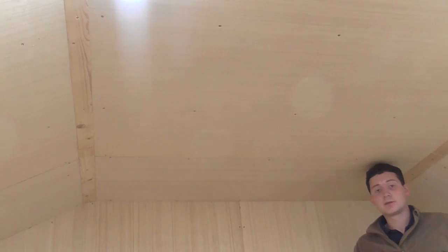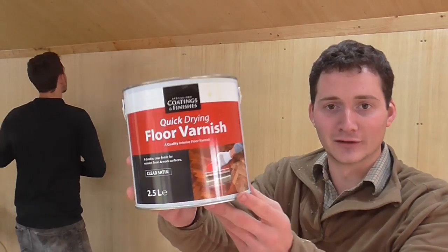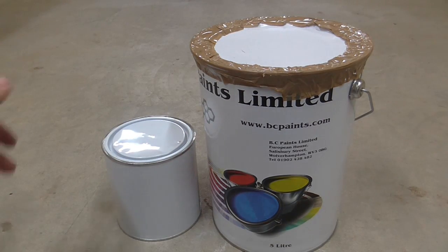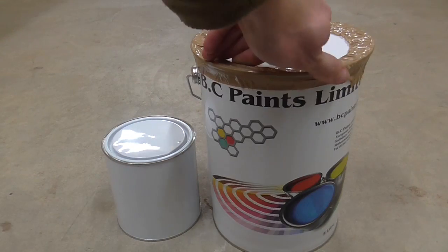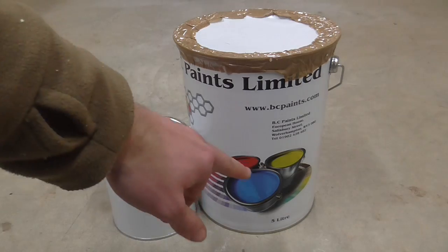Well that's that. Next up I'm going to varnish it all. Nearing the final stages now and I'm varnishing all the plywood. I've got through my 6th tub of floor varnish and Stephen here's taking pity on me and come to give me a hand. Following this all that's left is painting the floor and from then I can start moving machines in. I'm now painting my floor using a 2-part epoxy paint — 4 parts of grey paint to 1 part of epoxy hardener. I'm using a DIY-type roller to apply it, doing 2 coats. I got the paint off eBay — Black Country Paints — and for the area which is about 36 square metres I'm going to use about 10 litres.